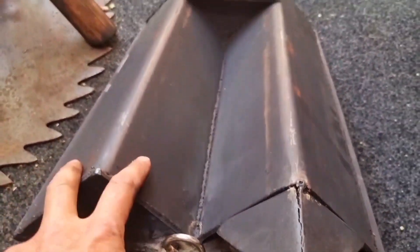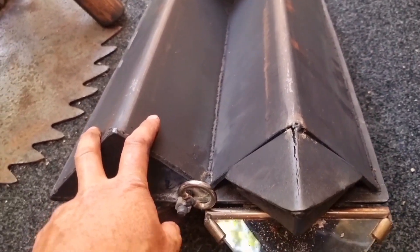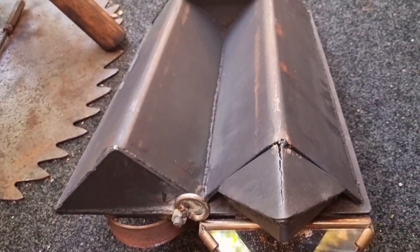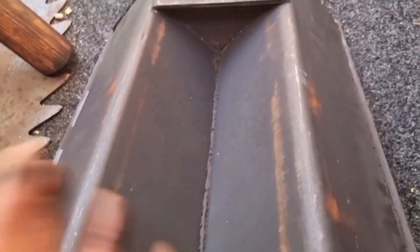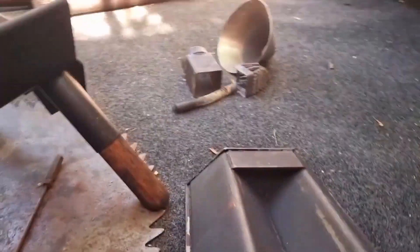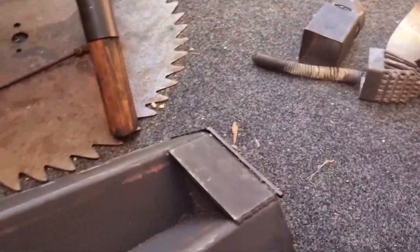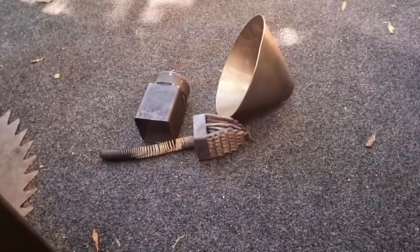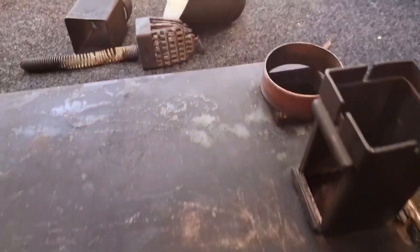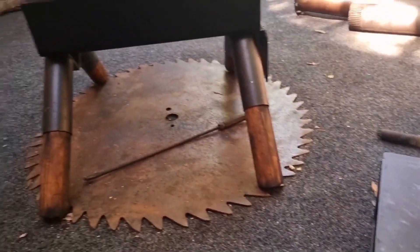But you can see what I've done — I've got some 125 mil square tube, it's about 5 mil thick, quite decent thickness, it just lasts forever. I've cut that in half and welded it onto a 5 mil base plate. I think I used Corten steel for that one — it's Corten steel — so it just lasts forever. Just gets a little coating from the heat, and this runs forever without rusting.